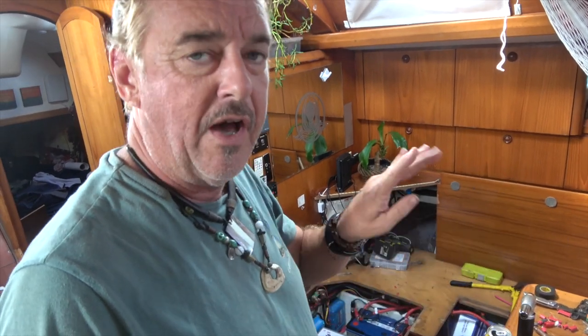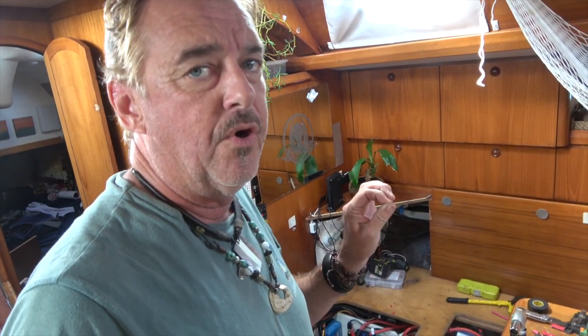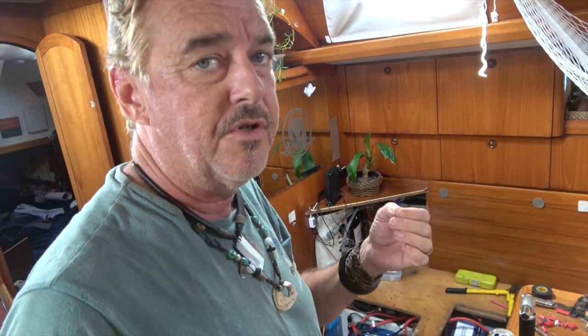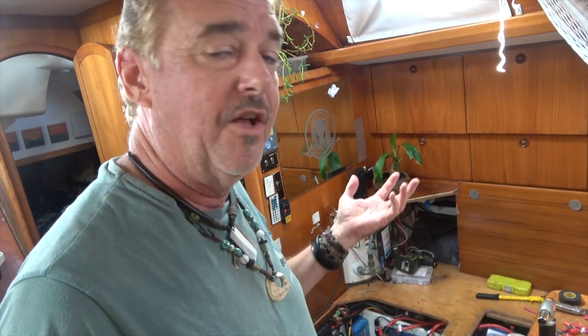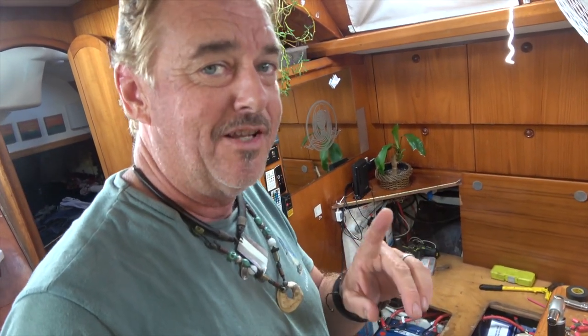And then you put the 12 volt battery in series with 12 volt, and now you have a 24 volt battery. So we have six 24 volt battery components on board, all in parallel with each other, which are netting us a combined total of 600 amp hours at 24 volts. Amazing. I mean, that's 15 kilowatts of power in reserve on Sophisticated Lady. That's the stuff I kind of dream about for a long time, and today it's reality for the first time.